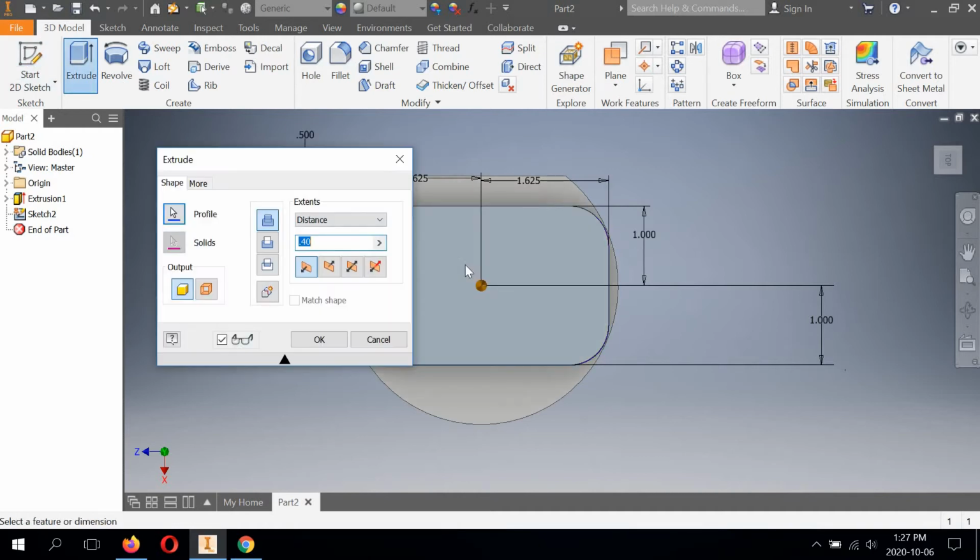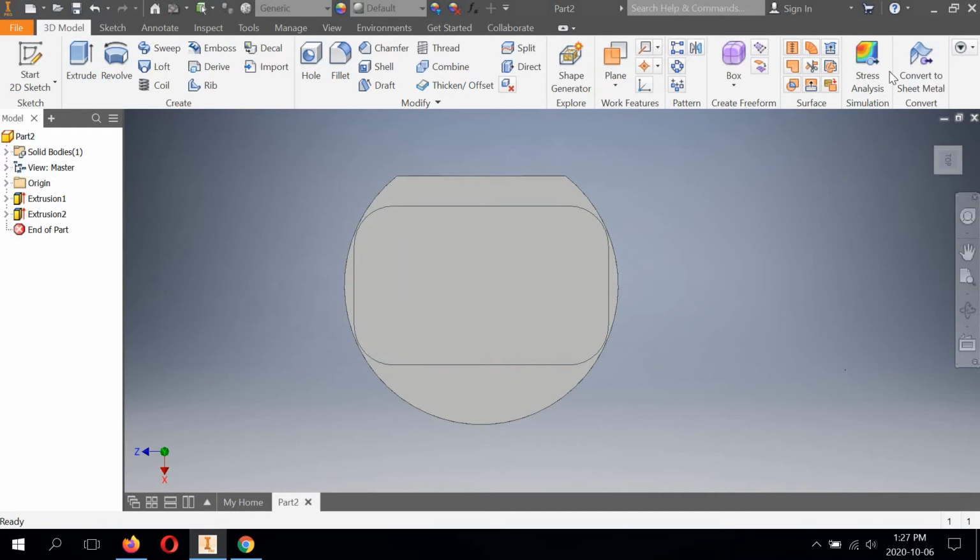and extrude. And we're extruding all the way to the top now. And it shows from the bottom all the way up to the top is 3.65. Now, before I hit OK, I have to subtract the base because the way it's dimensioned on the sheet, it's showing the overall height from very bottom to very top. I've already extruded the base, so I need to subtract the base away. So minus 0.4, hit OK, and here we go. We've got it.